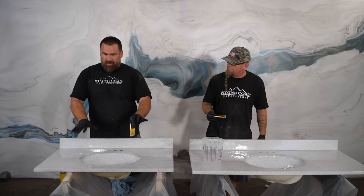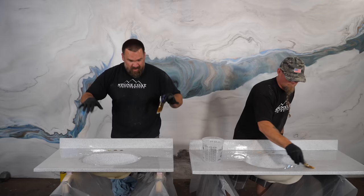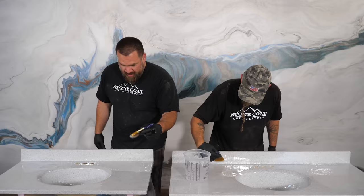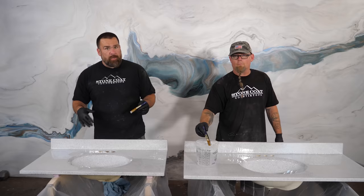I just kind of brush it on starting at the top and it'll run down. As the epoxy thickens — maybe 45 minutes from now — I'm going to come in and scoop it out down the drain so this stays low. Same with our edges: we have a raised edge, so if I just poured a huge amount of epoxy it's going to fill all the way up and you'll lose that detail. This coat is just knocking down ridges and adding more resin. If you've done your two coats on your stone spray vanity and still feel a little texture, mix up another thin coat and apply it.